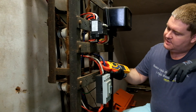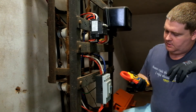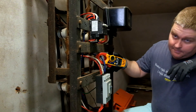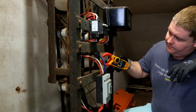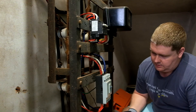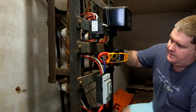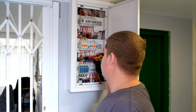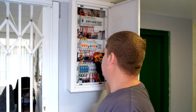So we're going to start with a 200-amp setting — we've got 9.1 — then knock it down to 20. We've got 9.96 amps basically hovering through this phase. You could do that with the other phases as well. Current measurement is basically a point of clamping carefully around the wire, taking a reading, and getting back out as quickly as possible. You could use your clamp meter around different points to calculate the current pull on each circuit — clamp it on and get the measurement.